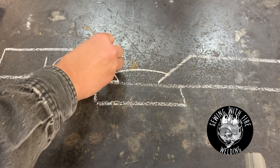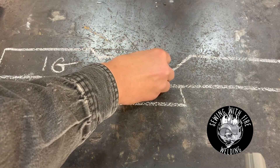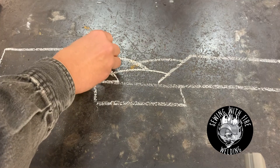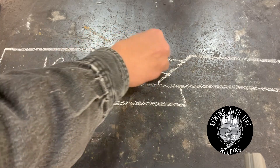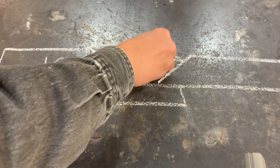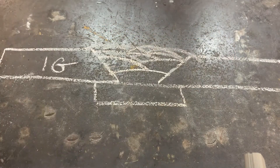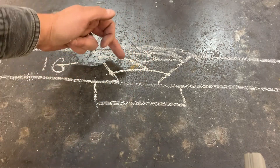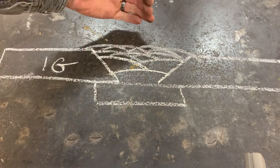Then I'm going to come in and put my second pass, something like this and like this. And then if I have to do a second fill pass — one, two, three — we'll do like that, and then I'm going to cap it in four: one, two, three, four. Now, this all depends on your travel speed. You may just have your root pass, your hot pass and fill, and then you cap right away.